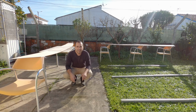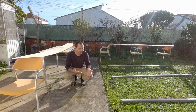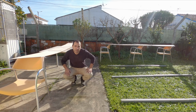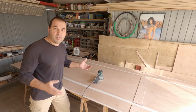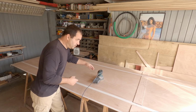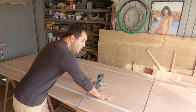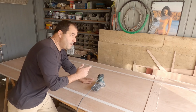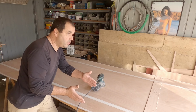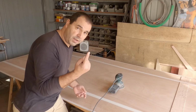Beautiful winter's day, so I'm going to take advantage of this beautiful sunshine and try to coat some panels, take advantage of the dry weather, so I can put the panels outside to dry. Before I go outside, I will start with the bottom. I will apply the recommended 3 coats of epoxy on the panels, but all the faces that are or will be inside the tanks, I will not coat more than once.